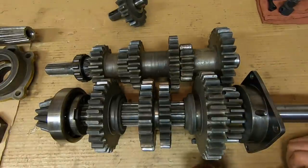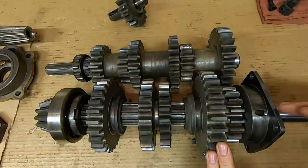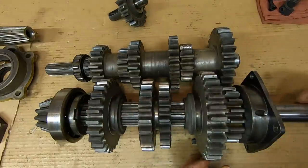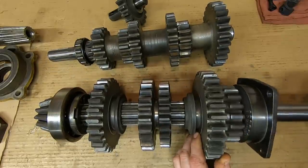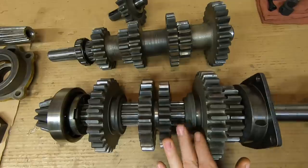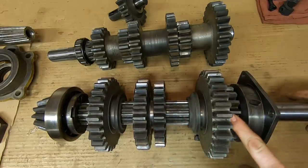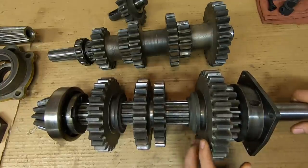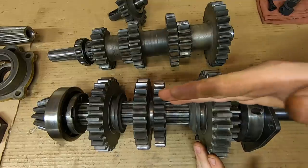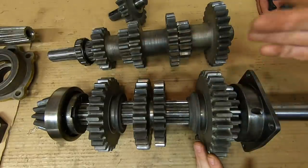Fifth gear now is kind of like my Farmall H. We basically bypass the counter shaft and turn it direct drive straight down the pinion shaft. So this whole time we've had the input shaft just spinning away, not connected to the pinion shaft. Well, this gear slides forward and meshes with some internal teeth to the external teeth of the input gear, and we've basically locked the pinion shaft in direct drive to the same revolutions per minute that engine speed is.